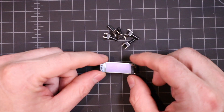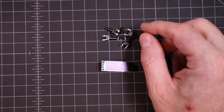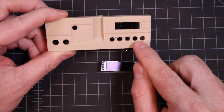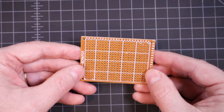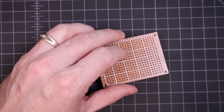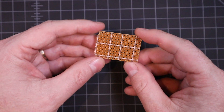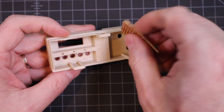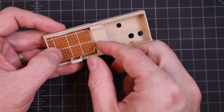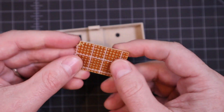The first thing we need to do is create a circuit board to hold the OLED display and the front panel selector switches, which will be visible in the front of the case. The OLED will go here and the selector switches will go here. I got one of these really cheap circuit boards — there's a link in the description — off of Amazon. I just used a razor knife and scored it, then popped it and created a little circuit board that fits exactly in the spot where the OLED display and the switches are going to go. I used a little bit of sandpaper to smooth the edges.